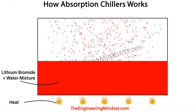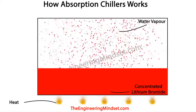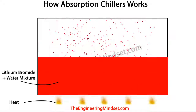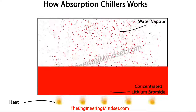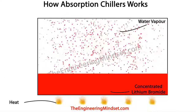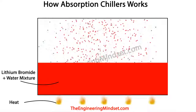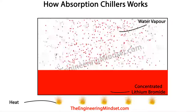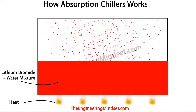The third point is that when water and lithium bromide are mixed together, you can separate them again just by adding heat. As you apply heat, the lithium bromide particles become heavier and condense toward the bottom of the tank, while all the water vapor boils off upward to become steam. So you can separate the two simply by applying heat.